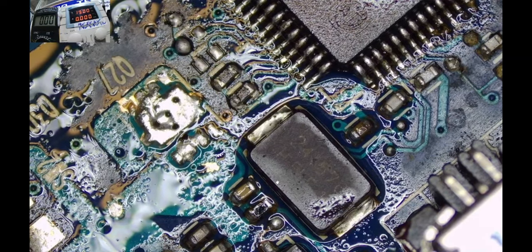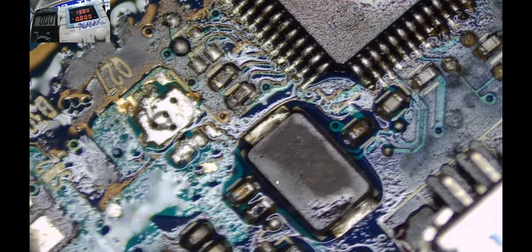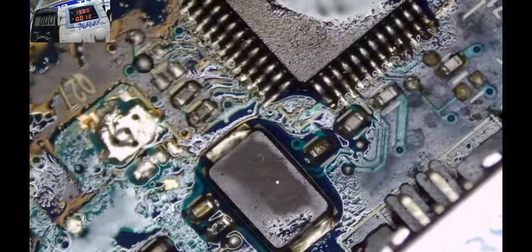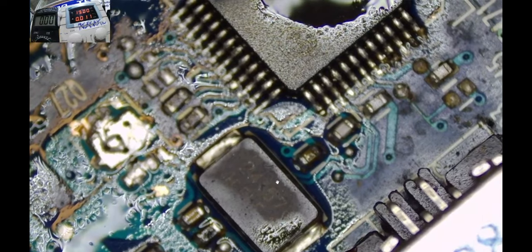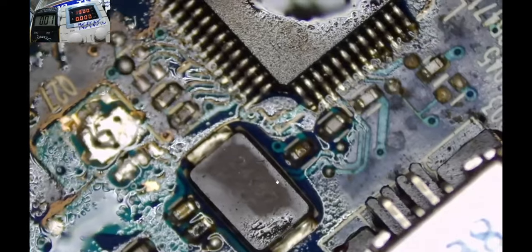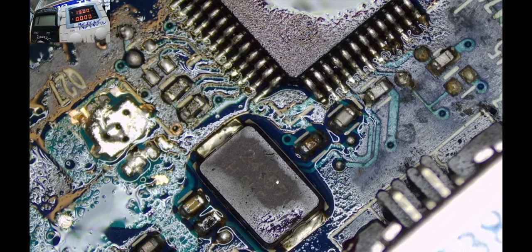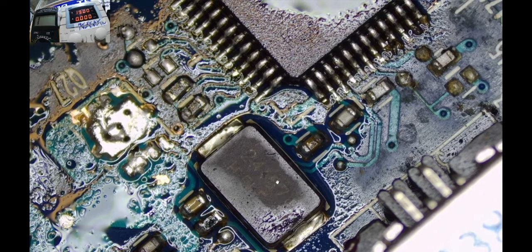Now let me check whether we are still having a shorted circuit on the motherboard. Connect, and now the short is out, guys, but I don't think we can tell this precisely without the MOSFET being replaced. So let me see an alternative. I don't know whether I should come with a multimeter here. There's still a short, guys. Check my multimeter there.